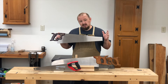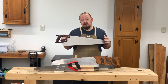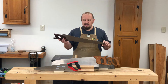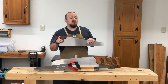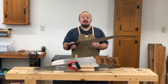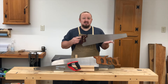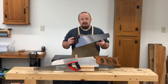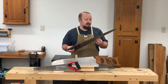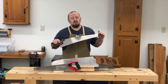In terms of the styles they come in, you can get them in Japanese style saws — usually machine-made, sometimes hand-sharpened after they're machine-made. In terms of Western style saws, they are almost always machine-made, and in some cases they claim to be hand-sharpened. This particular saw says right on it: taper ground, hand-set, and hand-sharpened. However, this saw is not sharp. If I did this with my other saw, I'd be in the emergency room for lots of stitches. This saw says hand-sharpened right on it, but whoever hand-sharpened it did not do a good job because it's not sharp. And that's one of the issues you find with these more moderately priced saws.